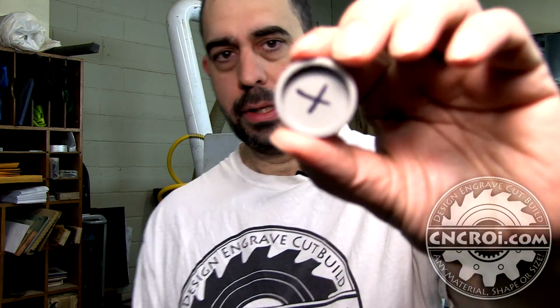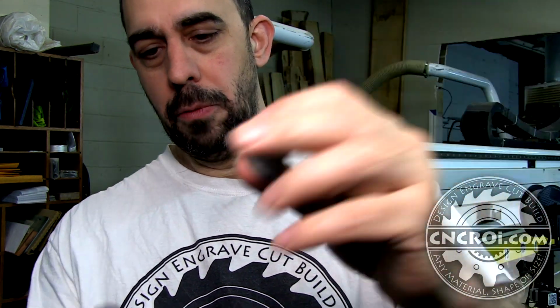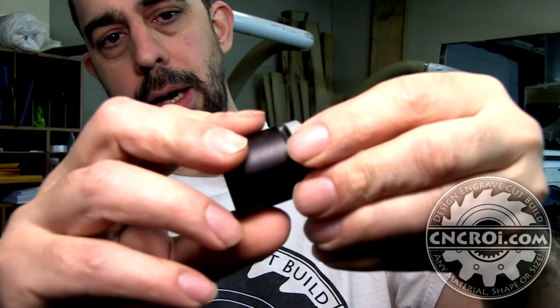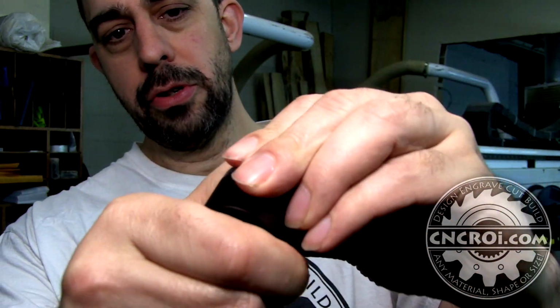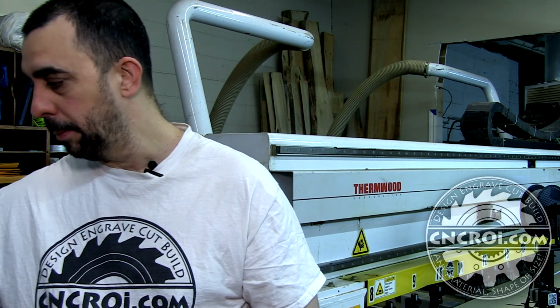I have experience doing 3D printing about 10 years ago, and this project is a great way to get back into it for this specific project. So the first test I did was, here's a cap. So PLA. It won't damage the threads. And I just did a test fit, and you can sort of push it in and it works. So that tells me that my tolerances with PLA are a little bit different than they would be with aluminum, because I used digital calipers and it was a specific perfect fit.